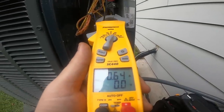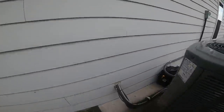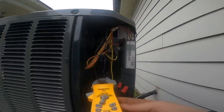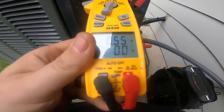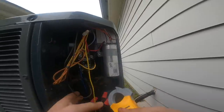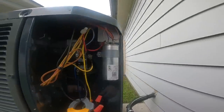Let's hit the fan motor. It's reading 0.6 and I think it was rated for 0.8 — let me double check that. Yeah, it's 0.64. It came down to 0.5, then 0.55, and 4 amps on the compressor. So we got a total amp draw on the whole machine of 5.2 amps, which is pretty efficient.